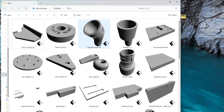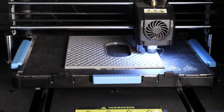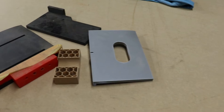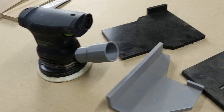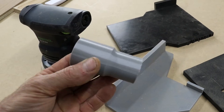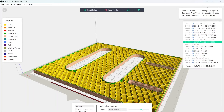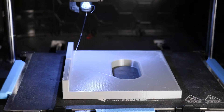So what do I use it for? Tons of stuff. Let me show you. The main use would be jigs. It's so easy to quickly draw up a jig in CAD and then print it out ready to use. Not only is it super accurate, it saves a lot of time, and once I've got the file I can just print any replacements or adapt it easily. It's brilliant for odd-shaped ironmongery or random off-cuts. In fact, a lot of ironmongery suppliers also offer a CAD file download with their products, so you can take that and turn it into a jig really fast with a little bit of practice.